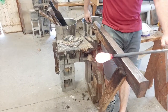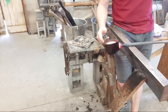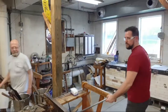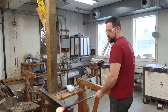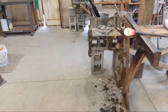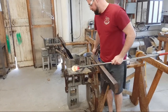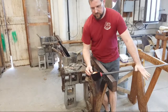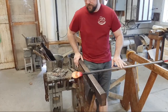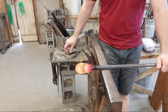That steam acts almost like a lubricant to let the glass slide easily across the cup. If the block was completely dry we'd get burning and sticking — a really bad mess. Josh now blows into the pipe, covers the opening with his finger, and the air has no place to go but out into the glass. People often ask if the pipes get hot — usually if a pipe gets warm it's because of residual moisture inside which heated up from the gathering and reheating process.